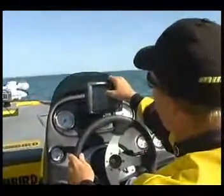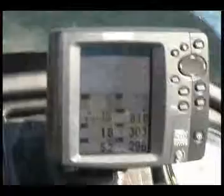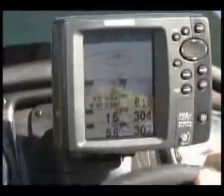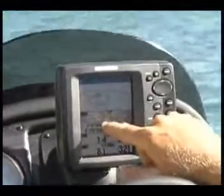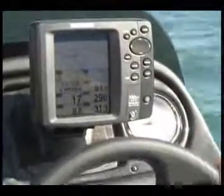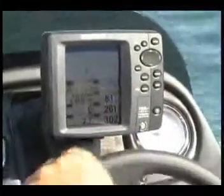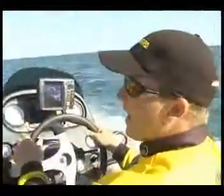All right, I've just come in off the plane now, and basically you've got this 30-metre arrival alarm around the first waypoint. So once I hit that arrival alarm, an audible alarm will sound, it'll cancel that bit of navigation I'm going to now, and then put a new track in to go to the next waypoint. So as we're coming in here, as soon as we get within 30 metres of that waypoint — as you can see here, we're 55 metres away now. So as soon as we hit that 30 metres, we're going to have an alarm sound. Just about now, as we're crossing it, you'll have that alarm sound, which is the arrival alarm, and it's going to automatically start navigation to the next waypoint for us. So I can see waypoint one I'm going over now. It's got to spin the boat around to the left a bit, head towards the next waypoint, which is about 6.9 kilometres away, and I've got about 17 to 18 k's to go in the track.